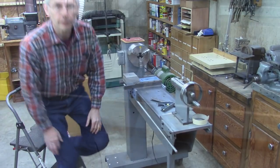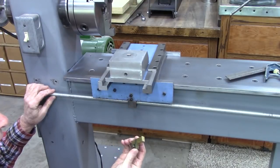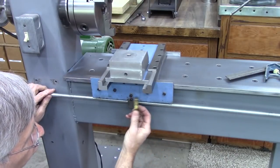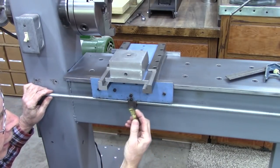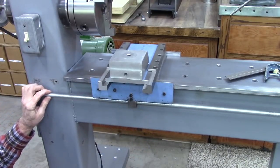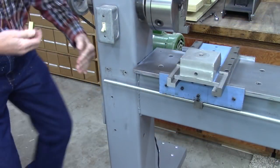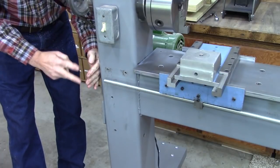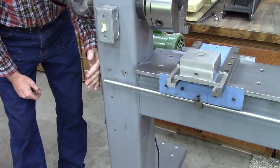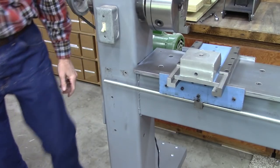Let me show you this lead screw. Here's my lead screw and here's the new nut I made — kind of like a half nut except it doesn't disengage. The old one had a tendency of moving and would develop slop, and the threads were kind of worn. I went up from 3/8 to half inch. Out here I need to make a plate with the NEMA 23 stepper motor mounting holes. That's what I'm doing over on the mill.